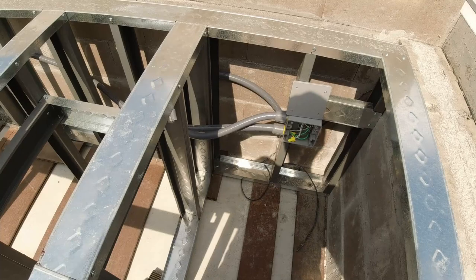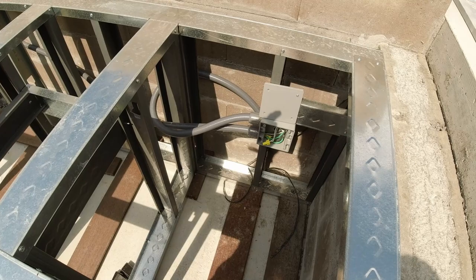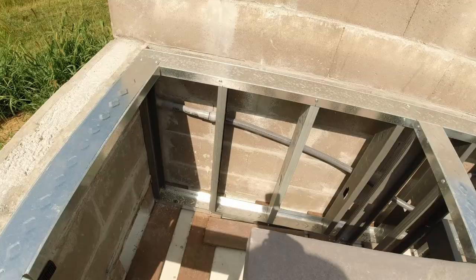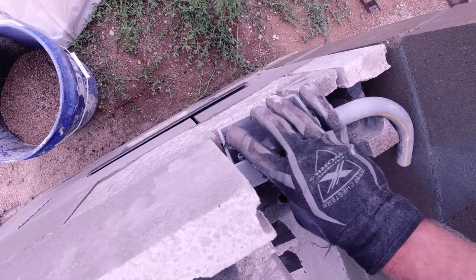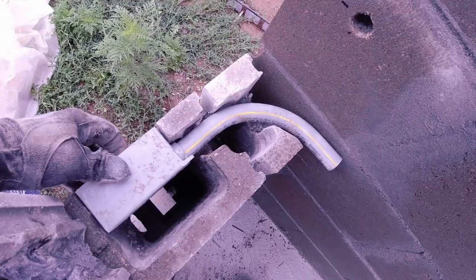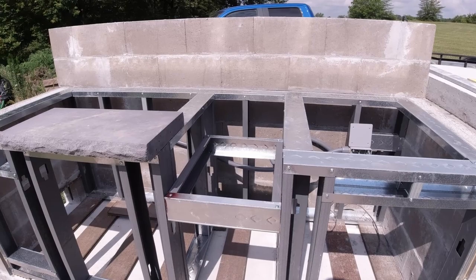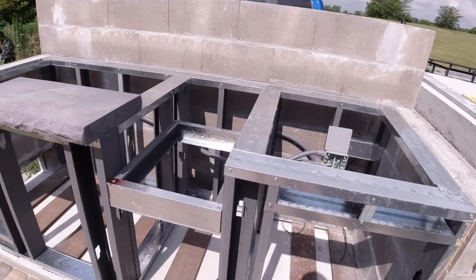For all electrical, use watertight fittings. I used one-inch PVC coming up, converted to three-quarter-inch watertight boxes and fittings, with 12-gauge wire for a 20-amp circuit. Over here I cut a hole in the block, put an elbow in it, glued it into the back, and encased it with concrete — it's solid. I didn't put any outlets in the front; I figured the side one would be good enough, and my island has two as well.